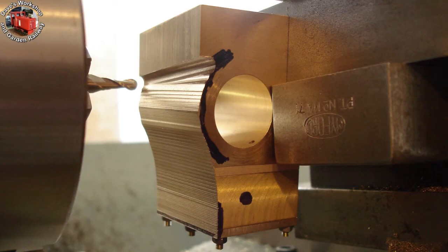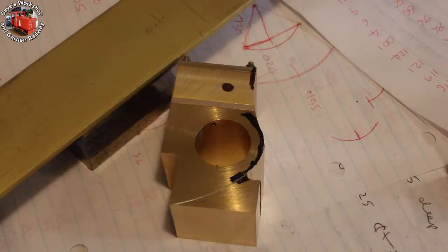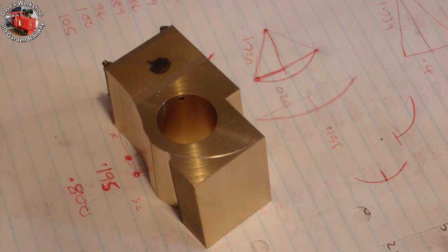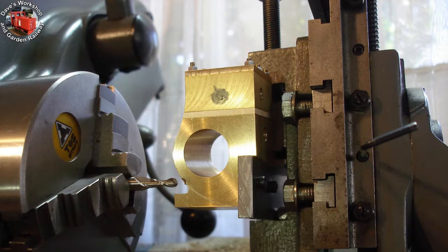Smoothed out. Marking the large radius on the front of the cylinder with a handy and convenient tin, and marking the smaller rear radius with my 60mm diameter wheel blank bar end. At last the cylinder is the right way up — cutting the small rear side radius, cutting to the marked line. There are no calculations here; it was all freehand.